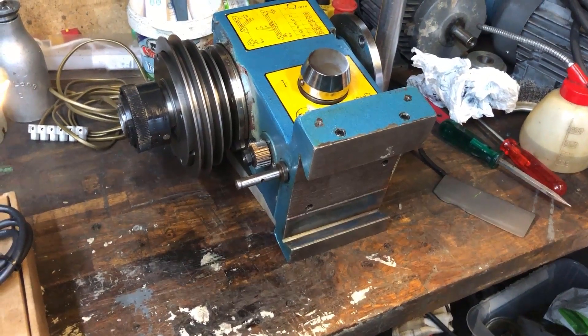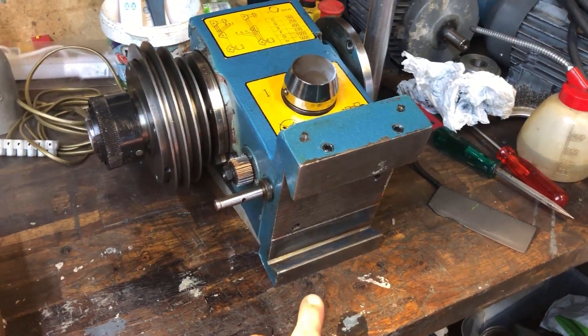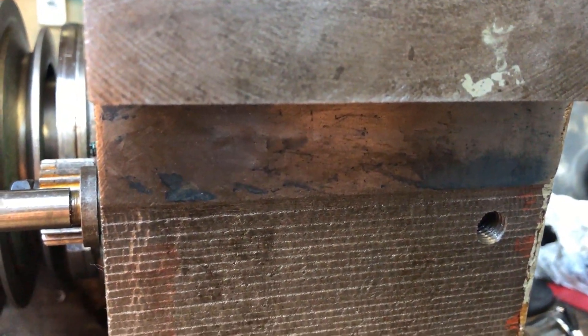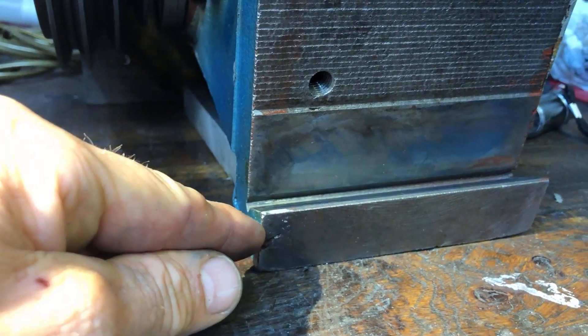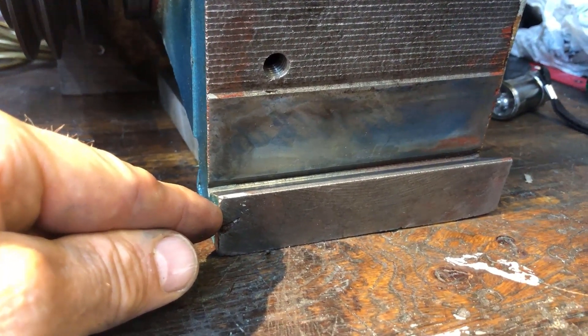Looking at the headstock, I will test and also improve the static bearing surfaces on the dovetail and the back and front flats. It's not too shabby really but could be improved. This gives us the rear reference point to the dovetail so that when this is drawn into the dovetail it shall be correctly aligned along the length of the bed.